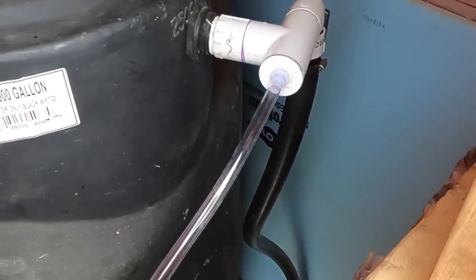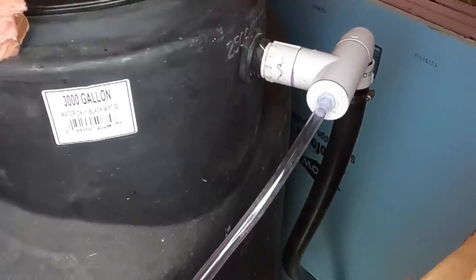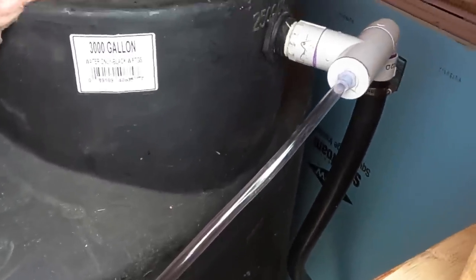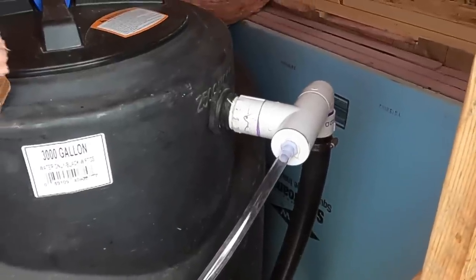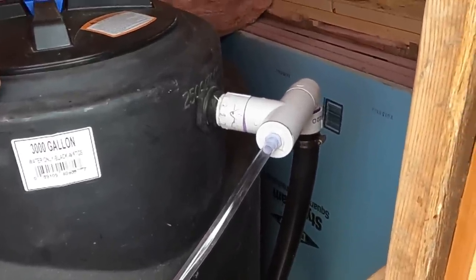This is going to go up. So this is my 1.5-inch supply line. Comes up to the top of this tank. Runs into a T that fills the tank. And I also have the 1/2-inch line that goes down the side that is my sight glass. So such as it is, that's what I've put together. I'm not a plumber, but hopefully it'll work.